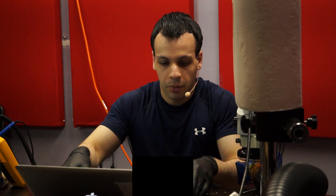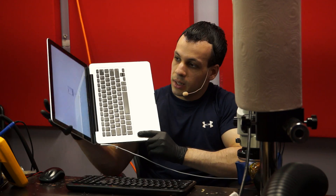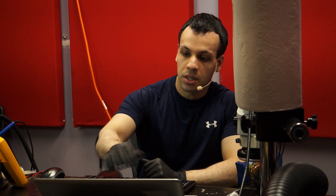Over here I have a machine and one of the first things I notice is that I have a green light on the charger. We've got a green light right there, which means the one-wire circuit is working. If the one-wire circuit is working and it's seeing the charger, now the next step is to see if it sees the battery. I'm going to boot up into the operating system and I see that it says the battery is 100% and also has a little charging icon, so it sees a battery.